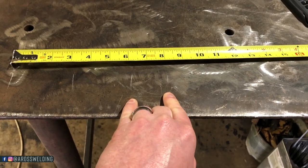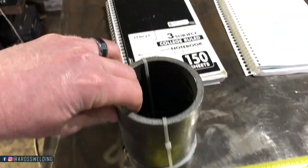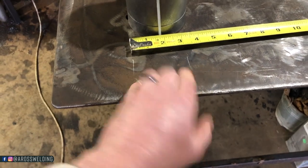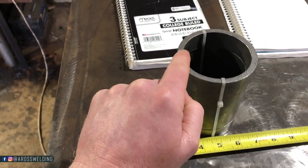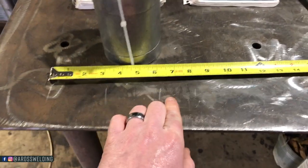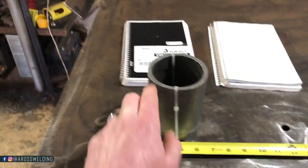And these could all fluctuate because I'm gonna be putting these hinges right here on the gate. I could really include this in my takeaways here, but sometimes, like 3 inches, that's 3 inches from here. I'm gonna be welding a piece of plate right here. Well, there's still a 1/4 inch here, so technically I need 3 1/4 times 2, which is 6 1/2. So that's a whole extra 1/2 inch that I haven't taken away here. So if I wouldn't have thought about this hinge right here, I may not have 2 inches here. I may only have 1 1/2 because I didn't consider this 1/4 inch.